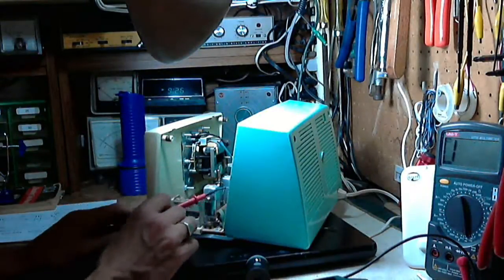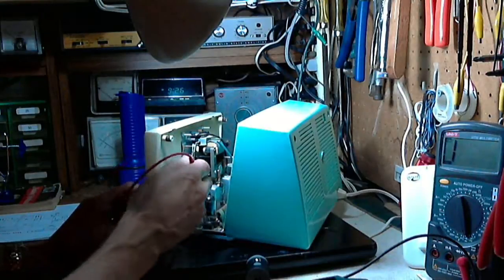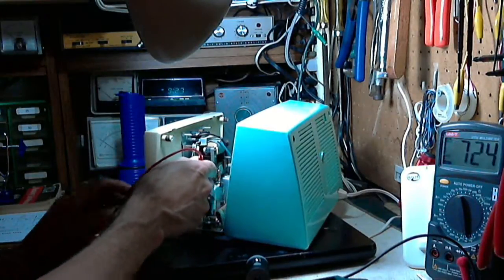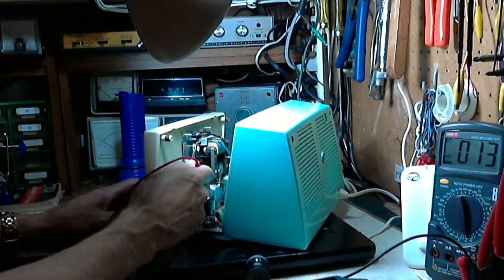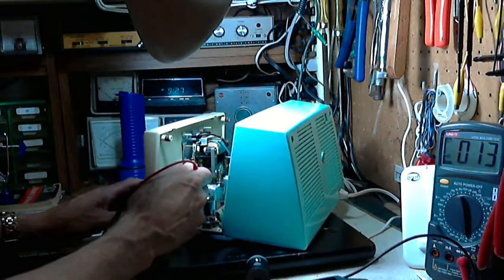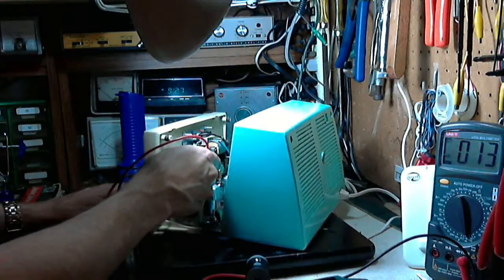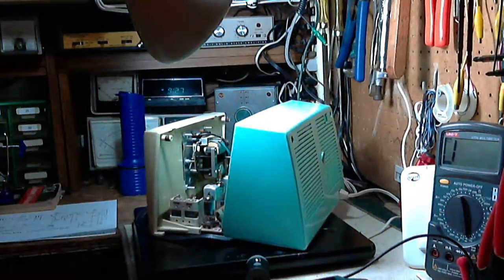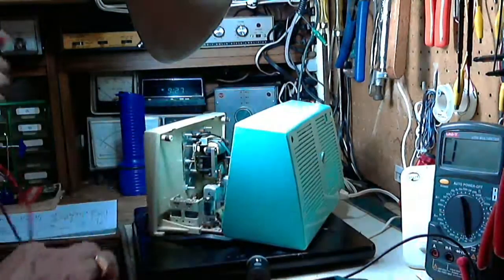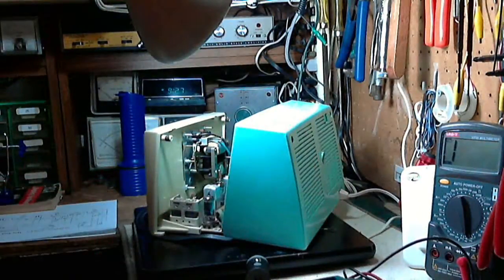So I think that tells you, undoubtedly, that the plates are shorting. I mean, I didn't have much doubt to begin with, but we'll try the other plates now. The other plates read 13, and when we go to the short area, nothing happens. And I'm not surprised. Pretty sure the second set I just tested are the oscillator plates. The capacitor for the oscillator.